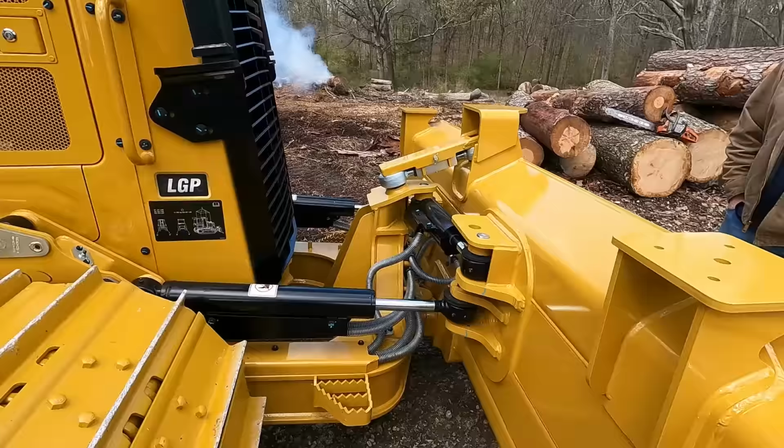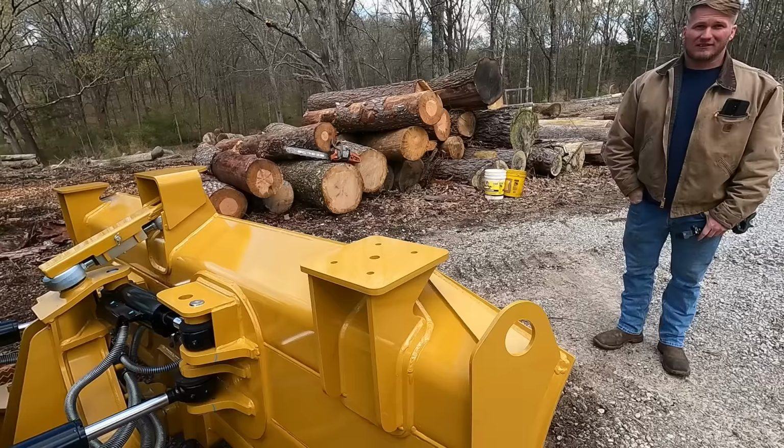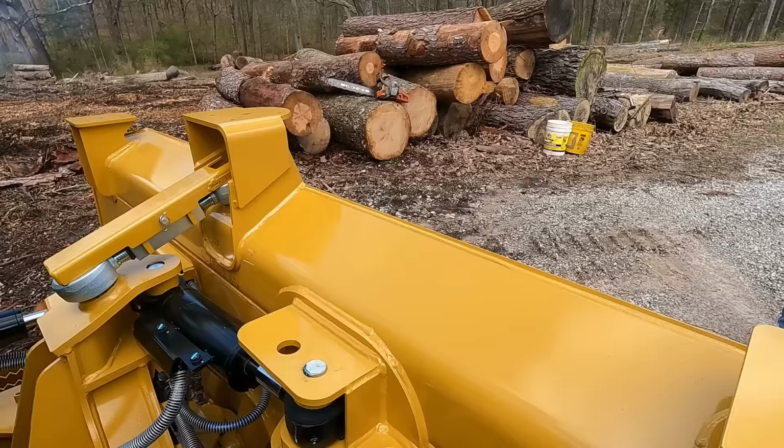It's kind of going to hurt my feelings to grind on a brand new dozer and weld on it. Hey, yeah, I'm sure you know this. Be sure and unconnect the battery. I was going to ask. Yeah, always, on any of this new stuff. Always disconnect the battery. Some guys say still unplug from the ECM. Do you have to do that?